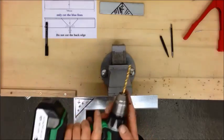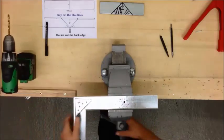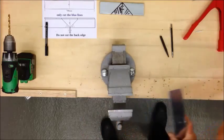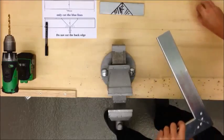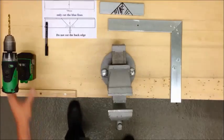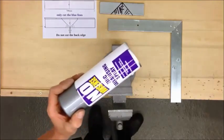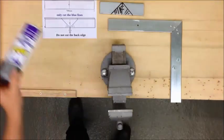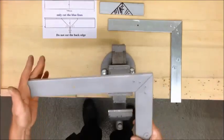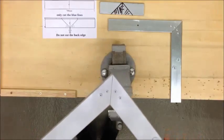For the roofing bolts I'm using a 6.5mm HSS steel bit. The last thing you would do — which I won't do here because it will damage my bench — is spray it with a zinc galvanising spray. This is one I did earlier; it's been sprayed with zinc spray, which will prevent any of your cuts or drill marks from rusting if this is outside.